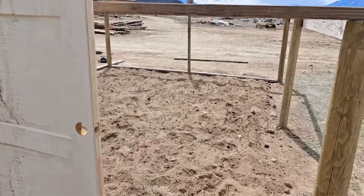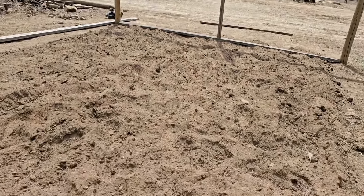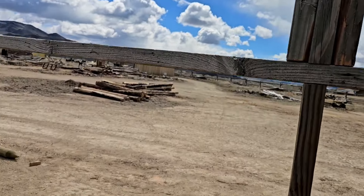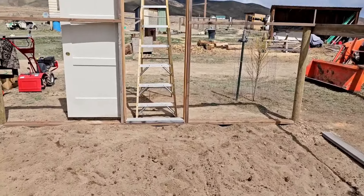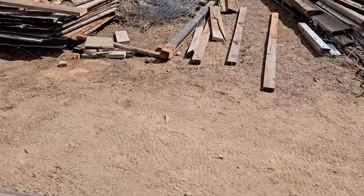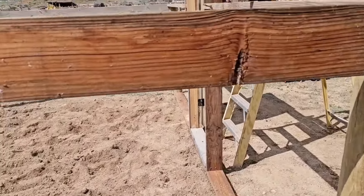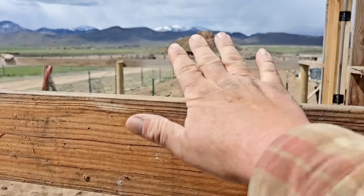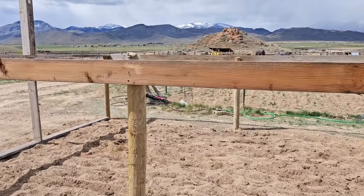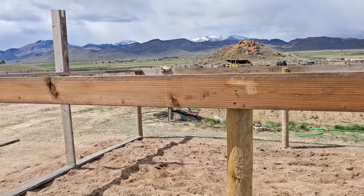I built myself a little cradle over there on that side and above the door here I built a little cradle — that's where our ridge is gonna go. We're getting ready to drop that in, and then after that we're gonna put some trusses on here. I'm going to use probably the two-by-sixes and just go flat across here, because there's not going to be any weight-bearing issues really. That'll allow that extra width for that plastic to be secured down without ripping.